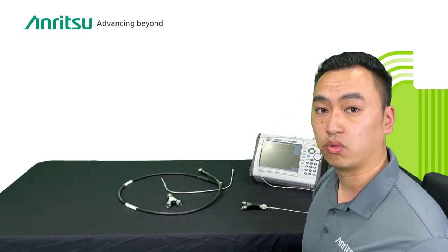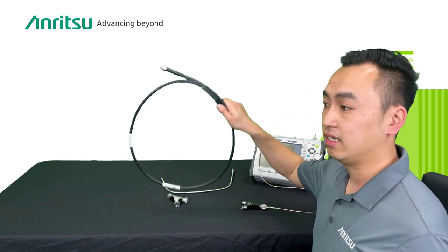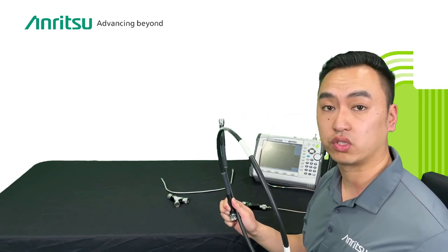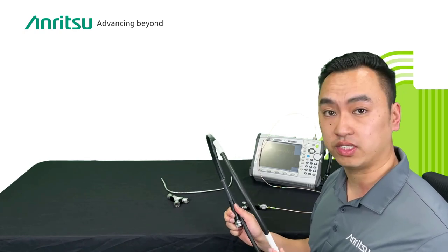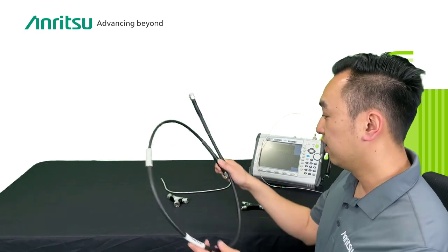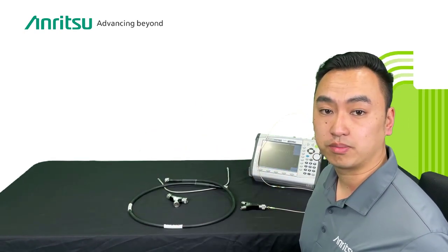This is the reason why it's important to test your cable before you use it. Whenever in doubt about getting poor measurements, one of the main culprits is your port extension test cable. It's very easy to do — just do an S11 or return loss measurement to determine how well your cable is performing. Especially with our cables, you can always look up the spec sheet and compare. I hope you found this helpful — thank you for watching and please subscribe.